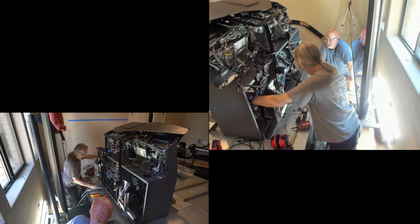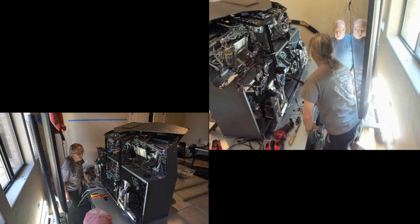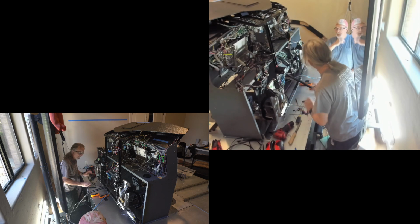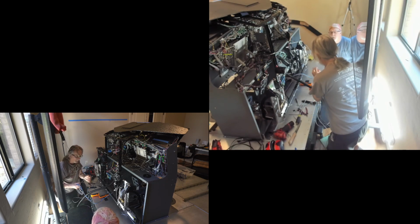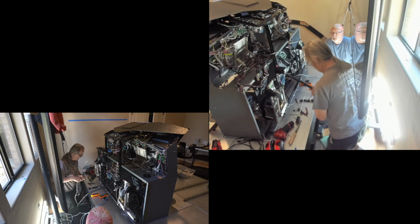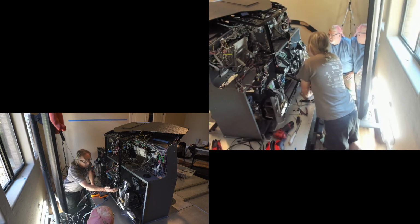So we put that bar in. We can adjust the bar with these nuts here if we wanted, but we're not going to. So we got that done, and then we put the network box down there. Before we go there, the connections for the pedals go to this USB board right here. We're going to get these connections to go to the yokes. So we'll have the buttons for the yokes and the pitch and the roll, and they'll connect right here. Then we'll have the wiring for the first officer's side, and this is the wiring for the captain's. It's all wired here. It makes no sense to run over and tie wrap it up, because we know the game: you tie wrap everything up just to cut it loose to put in new wires. So we just let them dangle for a bit, but at least we know everything comes across here, hooks up there, and there's the USB.